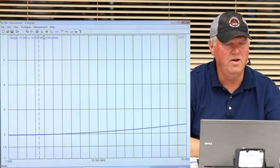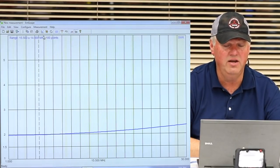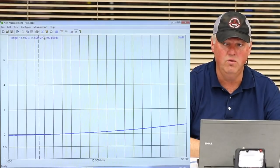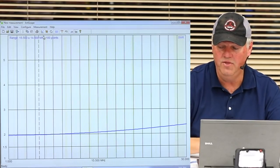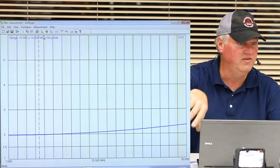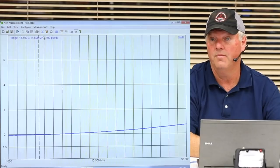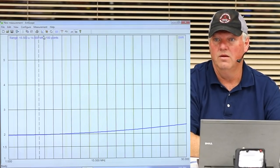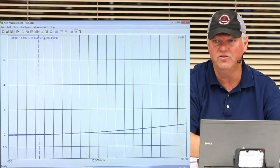Yep. So now the device looked at my antenna and said, your antenna is tuned improperly. So you've checked your coil, your matching device, with one of these analyzers, and you know that this thing is right with the resistor. Could I run that through an antenna tuner if that was a real antenna? The answer is yes, but you don't want to do that until you've determined that you've got your antenna as good as it's going to get.